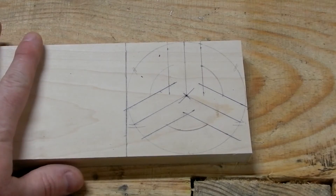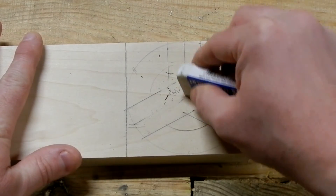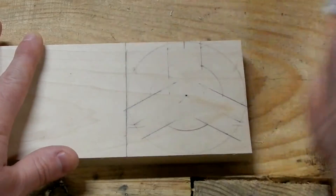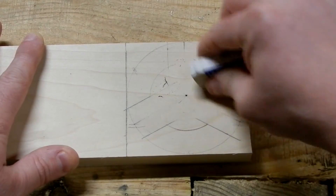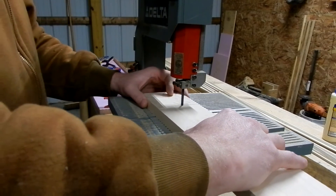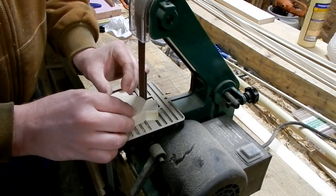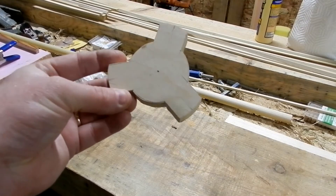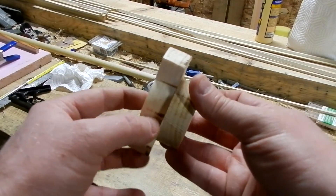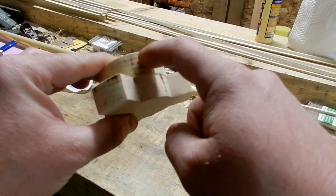Here's the basic design that I'm going to go with for the piece that holds the three legs, but we don't need all these inside marks messing me up on the saw. Here's the piece for holding the legs at 120 degrees. I went ahead and made a circular piece to glue to the bottom of it so that it will be a bit thicker for when I have the post coming out. It will even offer me a place to put a thumb screw.